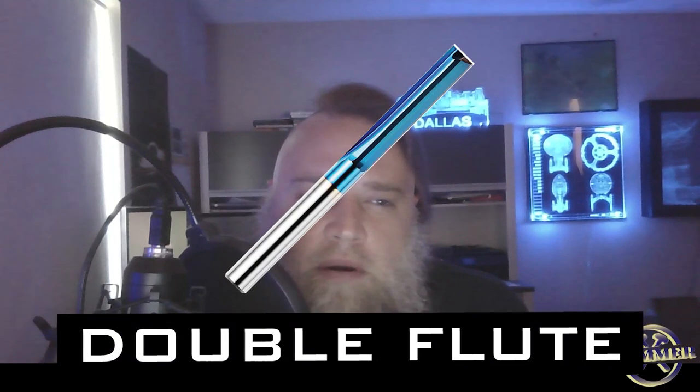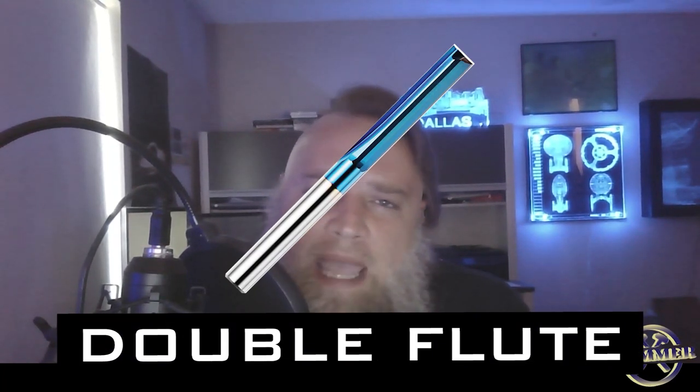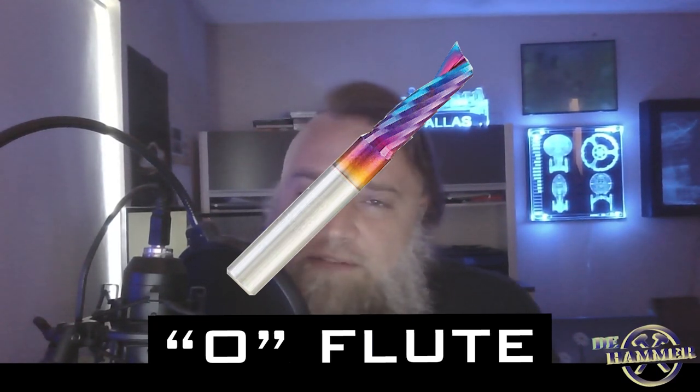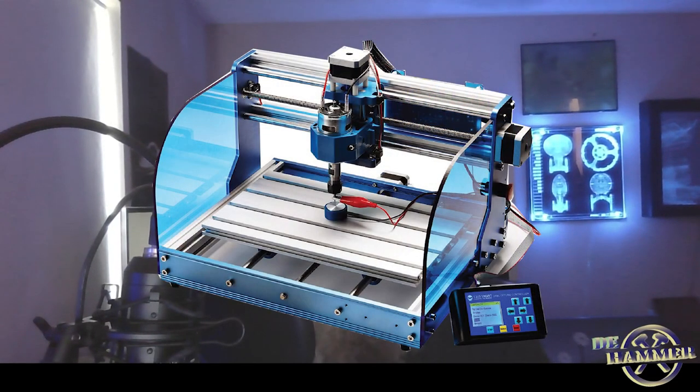Hello and welcome everyone. Do I have a story for you. For the past two weeks I've been testing out the Jamit 2 quarter inch shank and diameter double flute end mill and an Amana 51404K spiral O-flute bit. It's also a quarter inch shank in diameter, and I was testing these out on my stock 3018 Prover. Stock is the key word here. Spoiler alert: the quarter inch bits beat the ever living daylights out of my machine. But more on that and how that was really my fault a little later.